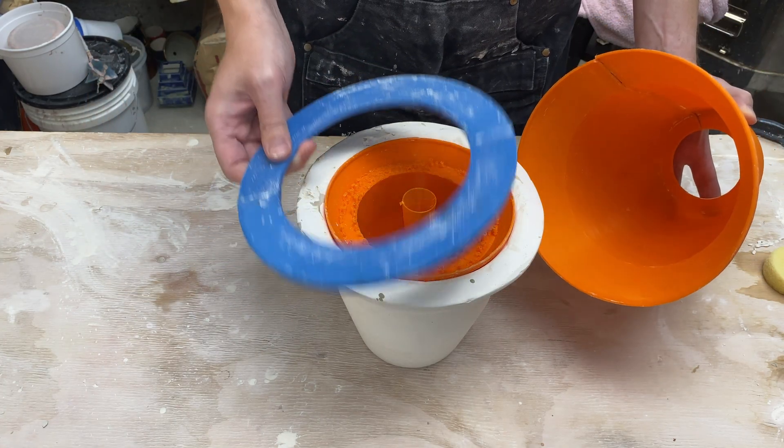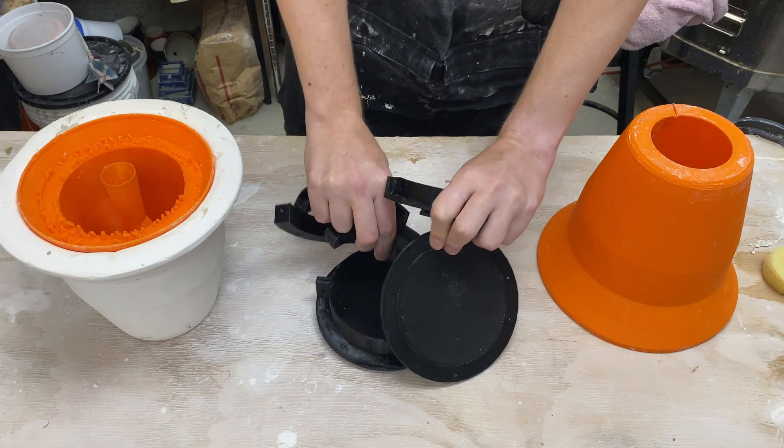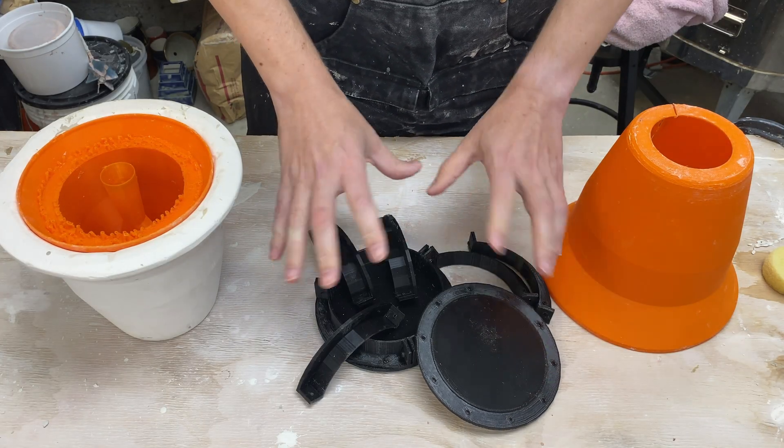In this video I was going to work on how this ring attaches to these pieces, and I've been 3D printing a bunch of prototypes. There was a great discussion on the last video and several people had different ideas on how to make the inner mold release more easily. I'm going to bump the attachment issues off into a future video and in this one I'm going to see if some of those ideas from the comments work on releasing the inner mold. For these one-piece molds it would actually be ideal to just be able to pour the plaster around the 3D print.